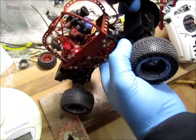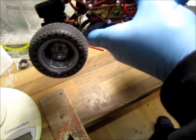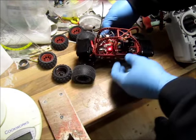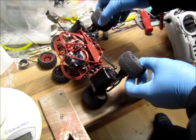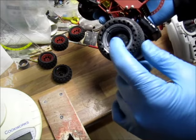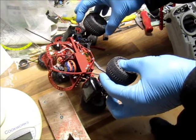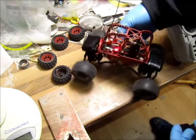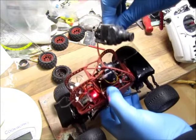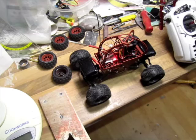I need a bit more powerful servo — these are 12-gram metal gear servos instead of the recommended 9-gram ones. With the stock wheels and all my modifications I could tilt to about 50 degrees before tipping over. With the new wheels plus the lead inside I can go to about 60 degrees before it starts tipping. I had to rebuild my pan-tilt system because I had a bigger camera and bigger servo which was way too bulky.